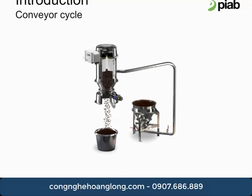The vacuum conveyor system is composed of a number of different components. The first major component is our suction point. This is where we feed product into the system. The suction point is typically a feed station, a feed adapter mounted to an external piece of equipment, like a bulk bag unloader or a customer-supplied hopper, and we can even supply just a basic handheld feed wand.